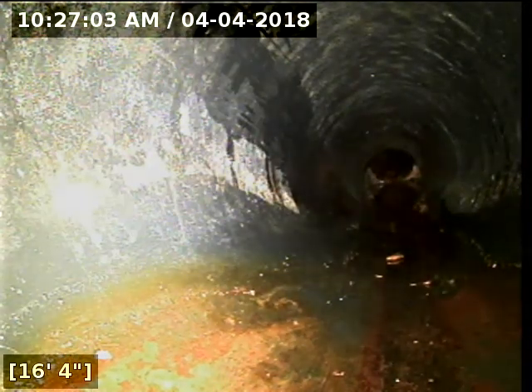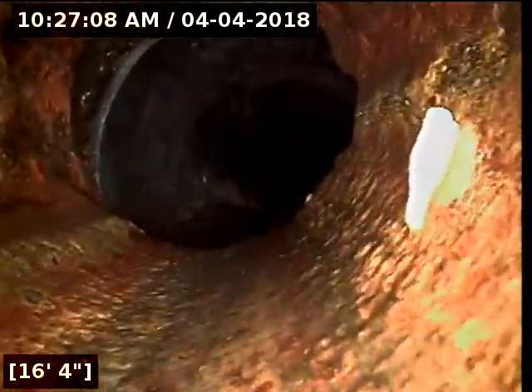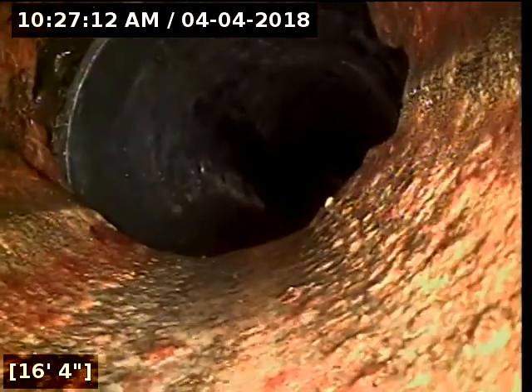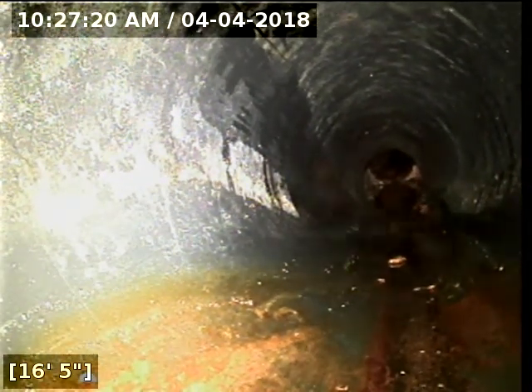I located the camera here at both ends of this ABS section. You can see here at the transition that this joint is also showing some movement — it's separated some, not a ton, but it is showing separation. And then the bottom section down there has sunk by almost two inches at least. So I recommend a spot repair here to correct this. It's marked with white paint.